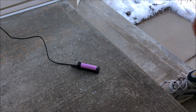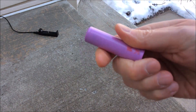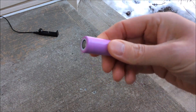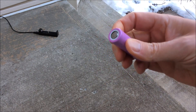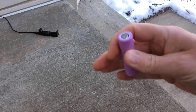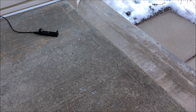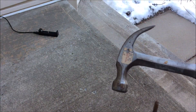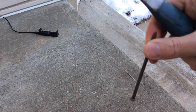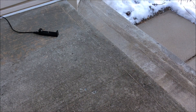I'm going to use a hammer and nail. We're dealing with a Samsung 30Q cell — this is an older cell, about 2 years old, I've used it a fair bit. Its capacity is down to about 2800 milliamp hours now, as opposed to close to 3000 when they're new, and the internal resistance is starting to rise. So I think it's time to recycle this battery anyway — and why recycle something when you can destroy it? I'll start with the negative end. Let's go somewhere a little safer.